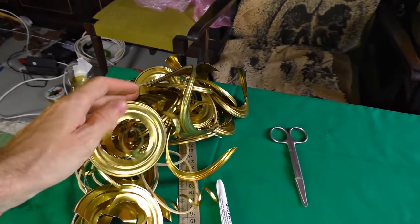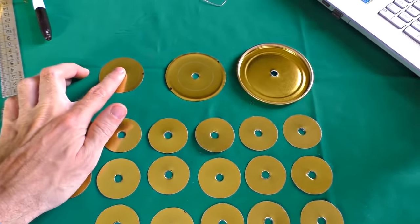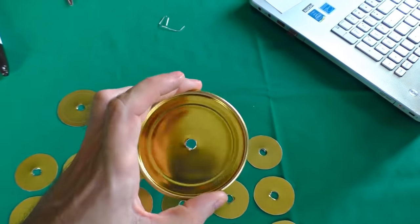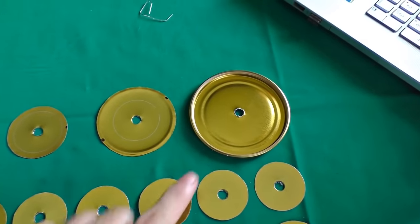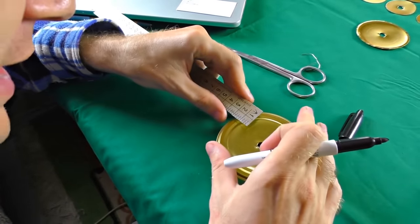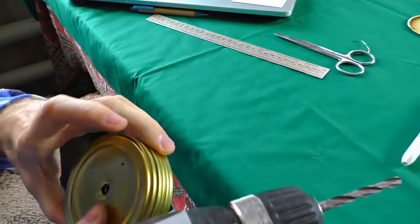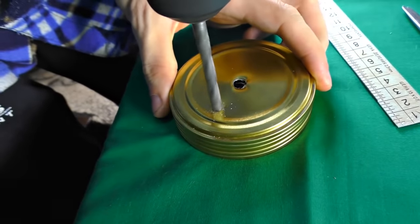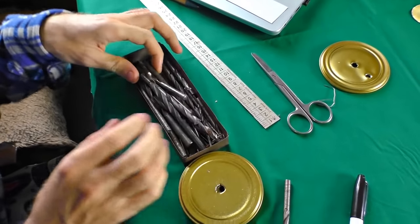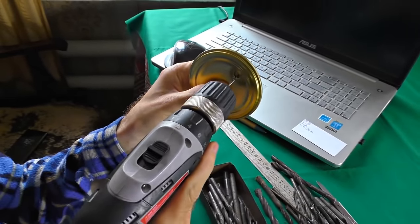We've got a nice pile of scrap metal here. As a result, I've got 17 4cm sized discs, one 5cm disc, one 68mm disc, and the biggest is 9cm — we didn't cut it because the cap is already 9cm. Now I'm going to make some holes for the cable in these two biggest discs. It is really important to make the holes 20mm distance from the edge. I need to use a 7mm drill bit for cable holes. Now I need to make a very little hole for the cable core — its diameter will be about 0.7mm. I put the first and second discs together and make a small hole right in the center of the big hole.